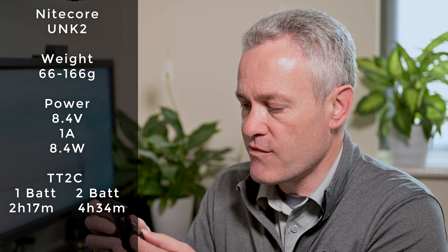Finally, we've got the RavPower 16750 milliamp hour portable power bank. It's got two charging ports - one at 2.1 amp and one at 2.4 amp - charging at 5 volts, so it's about a 12 watt charger. In terms of theoretical time to charge in camera, it should be the same as the EH7P. If charging through one of the other chargers, then it will be related to the charger itself, as it's got more than enough power for those. It retails at about 30 pounds in the UK.